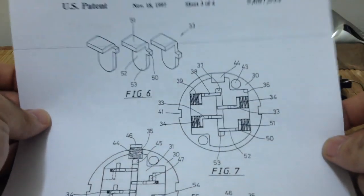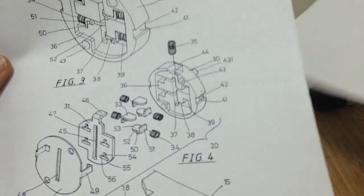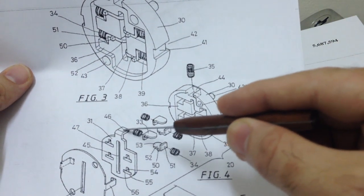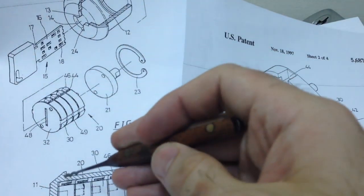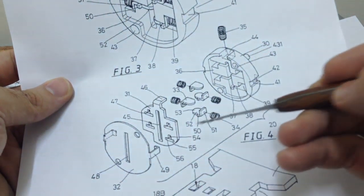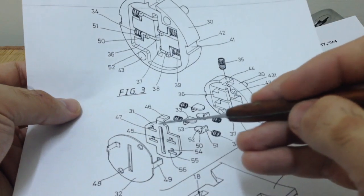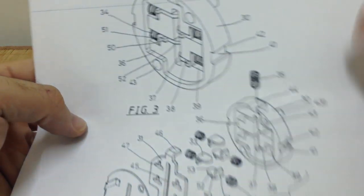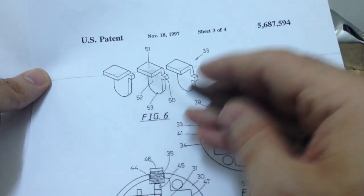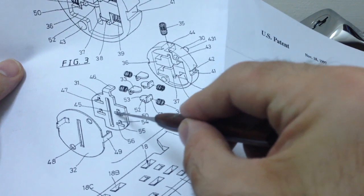Then obviously you might ask, what blocks it from being pushed down? Well, each segment here has a faceplate, and so this is that piece that was blocking. That's this right here. So this is part of this faceplate, and within each faceplate there are these T-shaped cutouts, right? And the pins, or they're not really pins, I'd say. They're kind of like wafers. These are what interact with the key. And these will fit within this faceplate, these T's, these cutouts there.